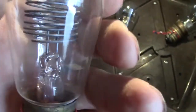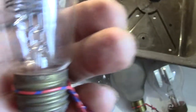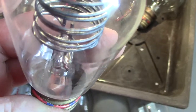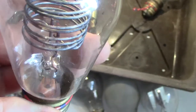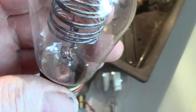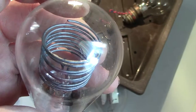There's no voltage on this, so I'd be wary. It's possibly 110 or it could be 230. There would be, yes, you can see it in the base, there's a resistor. So, you know, you have this, try it on 110 volts first, or even lower than that, 70, 80. A variac is certainly a thing you need. They're very, very handy. One day I'll get my one out and we'll have a few demonstrations.